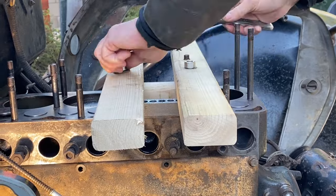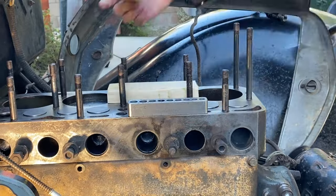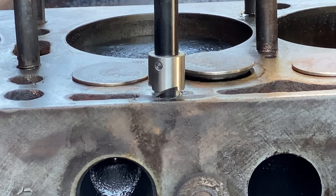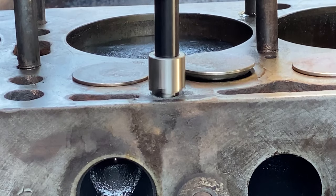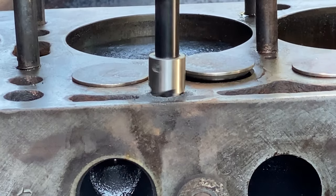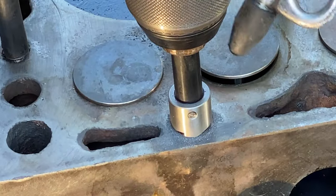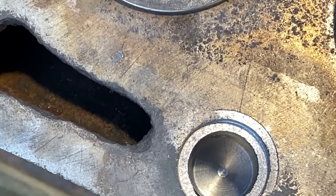Let's pull this off and see what we've got. Hopefully I drilled that just right. Yeah, that looks nice and clean. Now it's time to countersink — the insert has to go in, and therefore we need that countersink. I was nice and gentle with it, didn't force it. Along the way I used compressed air to blow off all the shavings — I always have compressed air handy. And there's the countersink, nice and clean.